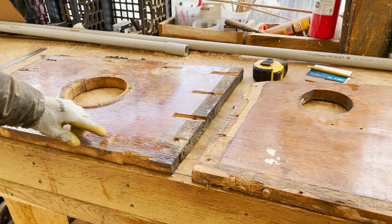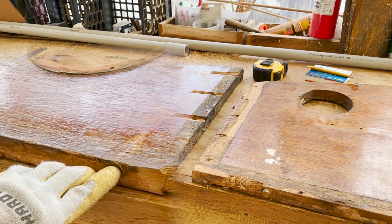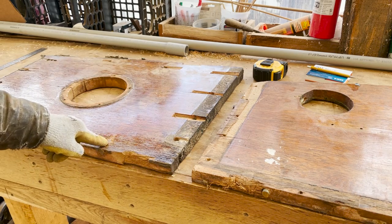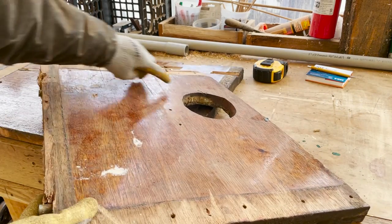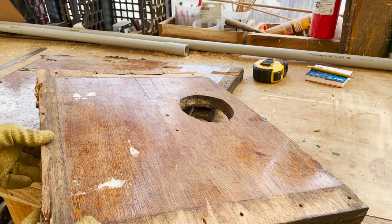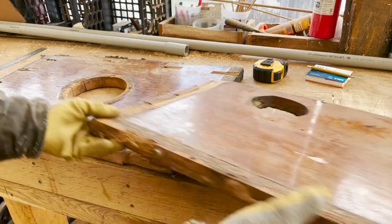So looking at these pieces, you'll note there's some discoloration here, which is a bit of rot, and that is because when they drilled, the bolt here is the rod, and it's just fractions of an inch underneath the surface. And this one, they actually hit the bronze rod when they did the port light, and they've ground almost all the way through it to put in the port light. So somebody was off a little bit there with that one.